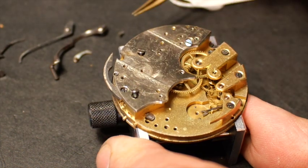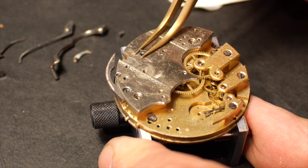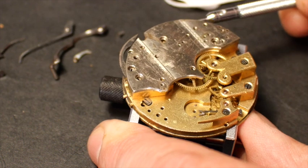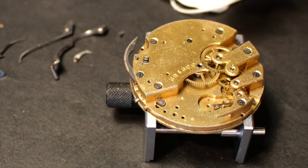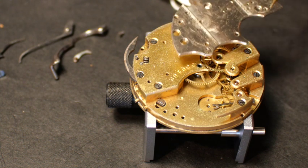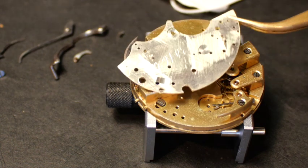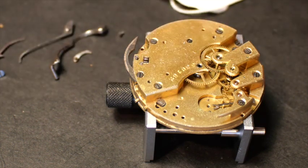It's getting late, so let's take this plate off and see what we can find under it. It looks like this plate was machined and fit — just machined to fit on this pocket watch frame. You can see the fitting marks on the back of the plate, and the serial number right there matches the front, which means the bridge and the main plate are from the same manufacturer. You can see the filing marks in the back — I have a feeling they fit the screws to it and then filed the back so it would fit down there.